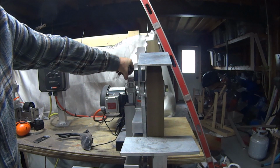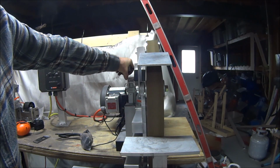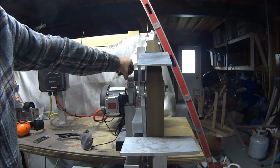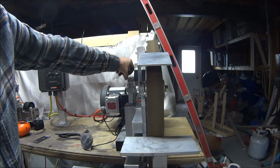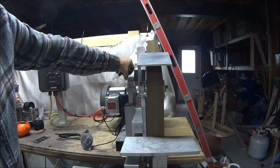And also the Trizact are able to run that. The Trizact actually, they have literature where they have grinding operations that are recommended up to 8,000 surface feet per minute on the Trizact. These are up in that same similar speed range on the Cubitrons. They really start to perform good up at those speeds.